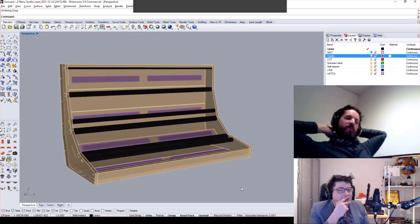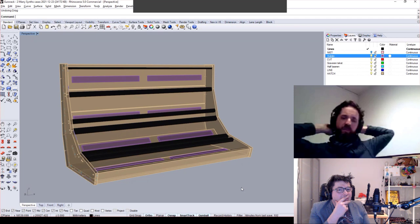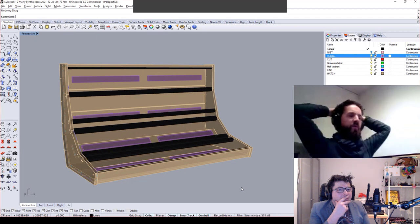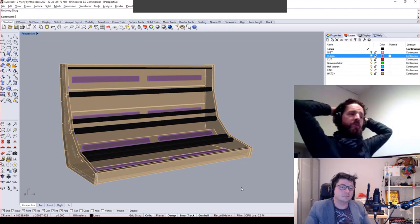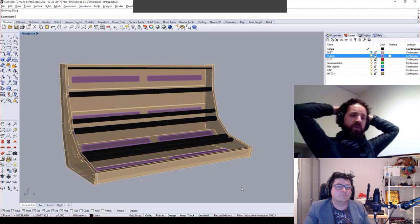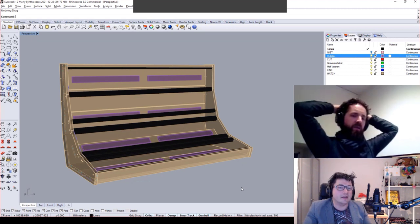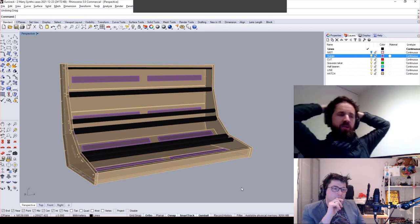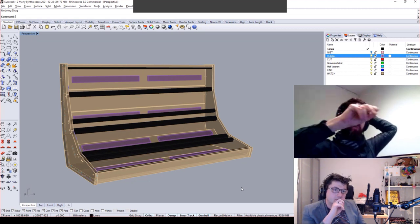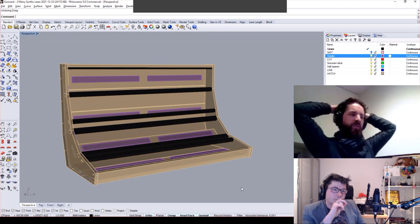True. Now with the brown oil and the black oil and the Osmo, I oil it when the case is in one piece, because I know that it works. With the new oils, I always take the case apart because then I can better control it. Every oil soaks into the wood differently, and in the corners it can get clustered up a little and become darker. I'm just a little bit more flexible, but that's fine.